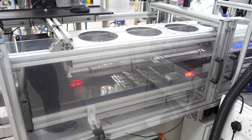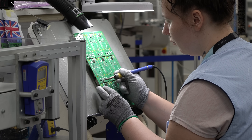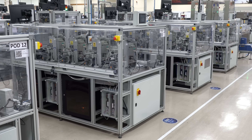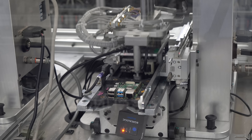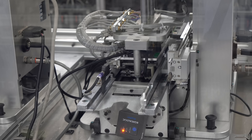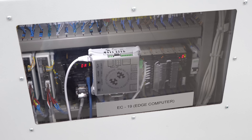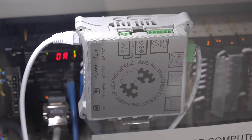After the boards cool down in the wind tunnel, they're checked one last time by a technician, and any spot that needs a little extra solder gets it. Then one of the most impressive parts of the line: a giant farm of 64 fully automated test jigs. All boards get individually tested in a bed-of-nails test fixture — SD card, HDMI connections, headphone jacks are all automatically connected. Then it's pass or fail. 99% of them will be a pass. And I kept finding more Raspberry Pis inside these little boxes — Pis building Pis all over the place.